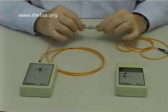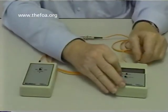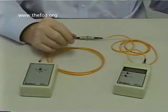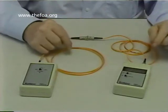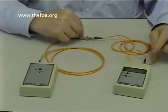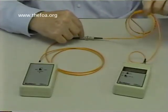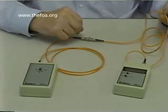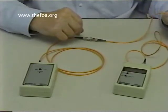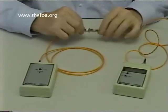Only use mating adapters that have phosphor bronze or ceramic alignment sleeves in them. They're a little more expensive, but they will give you much longer service life — 500 to 1,000 connectors or more. The other end of the cable we attach to the power meter. The power meter has a large area photodetector in it, so it gathers all of the light and has, in effect, no loss. Even at 850 nanometers, a one-meter length of cable has only about three thousandths of a dB of loss in the fiber itself. So the loss we measure is really the connector loss.